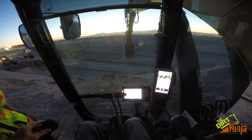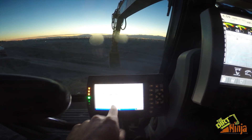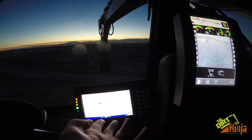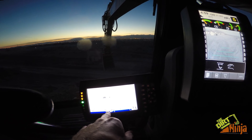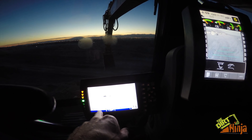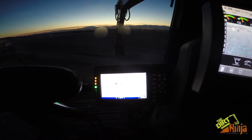If you look down here we have a slope — this is already programmed in, so you could basically program anything in here or off your plans. If it was level, obviously you would not have a percent pitch. Basically it's just like my flex system, telling me how far away I am from grade, and as I go down the numbers adjust.